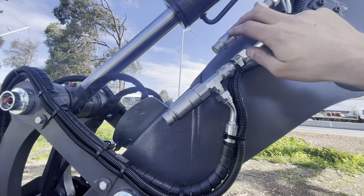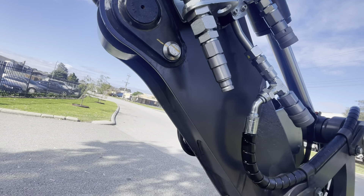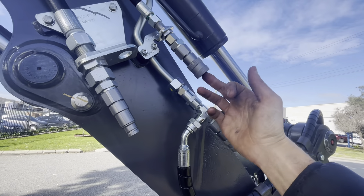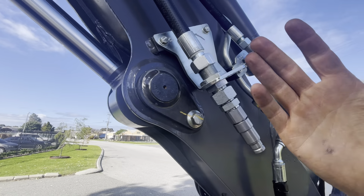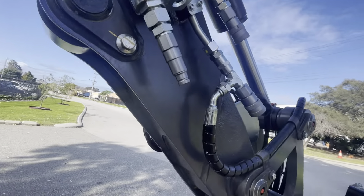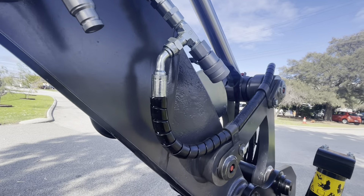Very simple to do. This is your second auxiliary circuit on this side. Around to this side, same deal — main auxiliary on this side, second auxiliary, and this is your case drain line. So with your post driver, you've got your hammer which goes into the main circuit, and then you've got your grab which goes into the second circuit. The hammer will come to the return line only because you only need one direction — so that'll go straight back to tank, and the feed for the hammer is on this coupling. The grab is on here and here. You can also still use it with the tilt rotator even though we're feeding off the same line — you just press a button in the cab to choose either the tilt rotator or the hammer circuit.